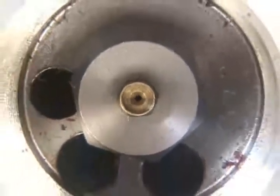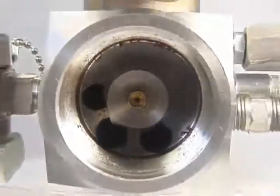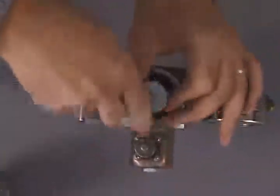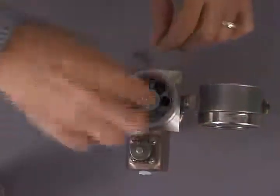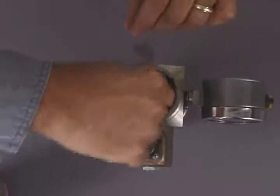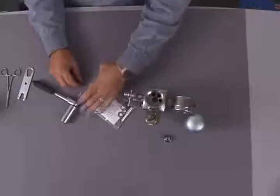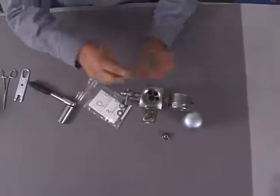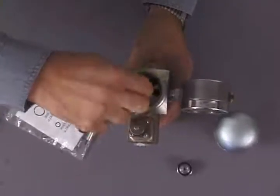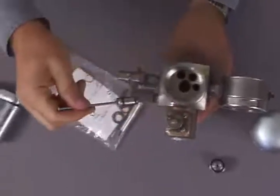The orifice is removable and can be replaced with a new one; however, the orifice is normally reliable and trouble-free. Step 2: Remove the orifice housing with a 7/8-inch socket wrench. Step 3: Take the repair kit 632 machine screw and screw it into the top of the gas valve. Step 4: Pull the gas valve from the housing.